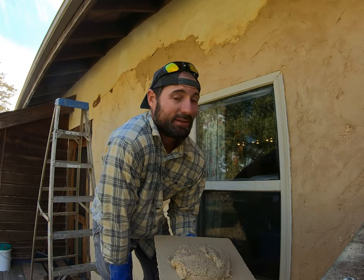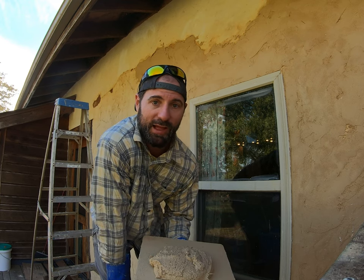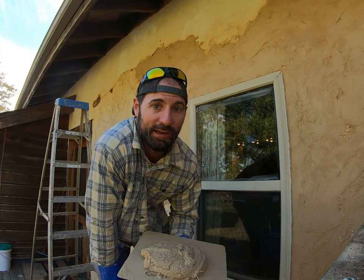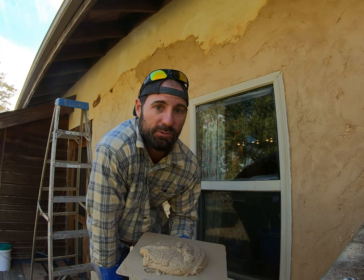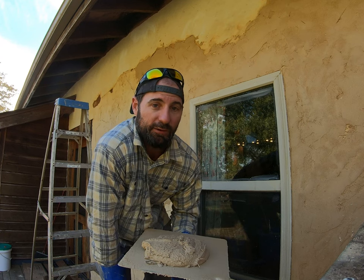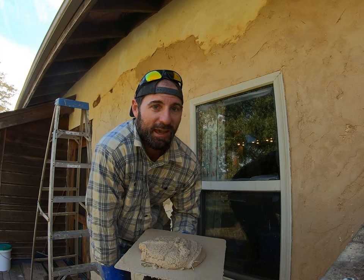So I'm gonna keep on doing exactly the same techniques that I showed you here, filling and flattening, really pushing that plaster into the wall to get a nice bond, flattening out the big empty spots that were there before, strengthening up anything that feels like it's weak, so that when that final coat goes on, it's going on to a really solid base, and that's it.